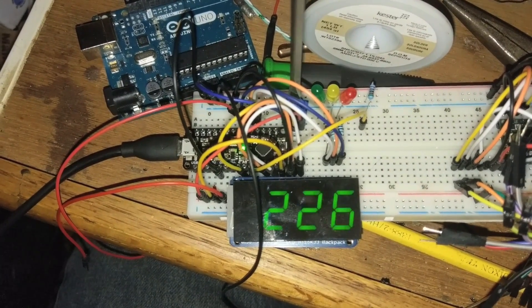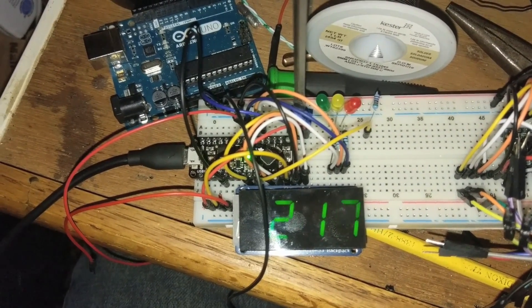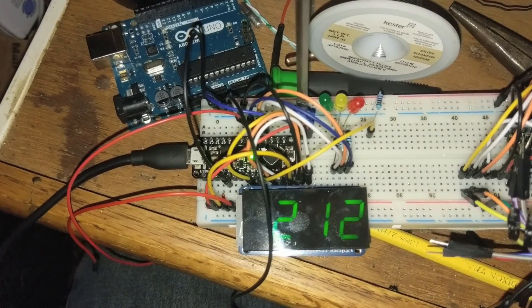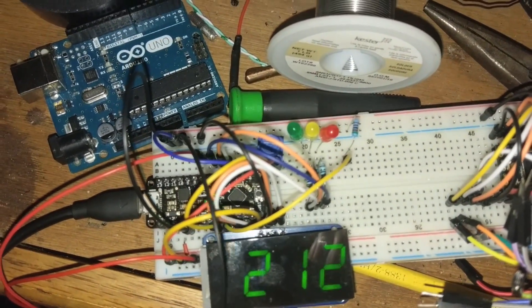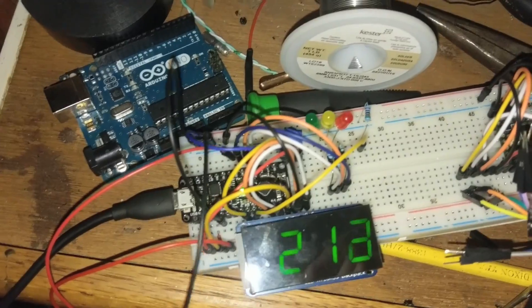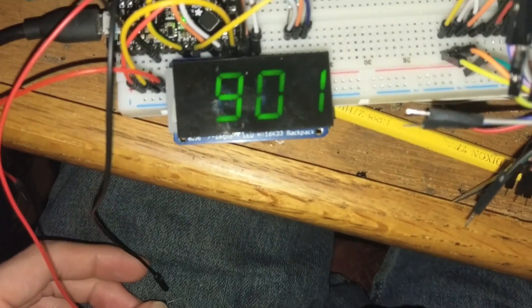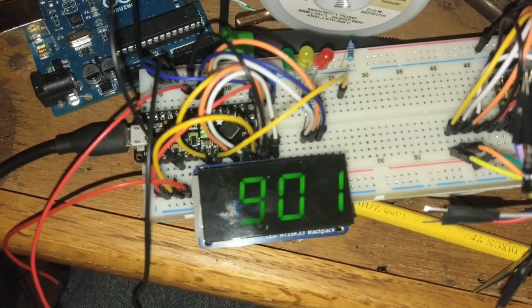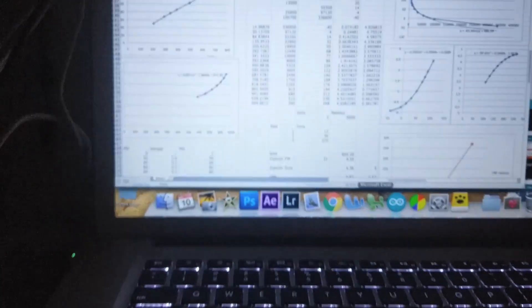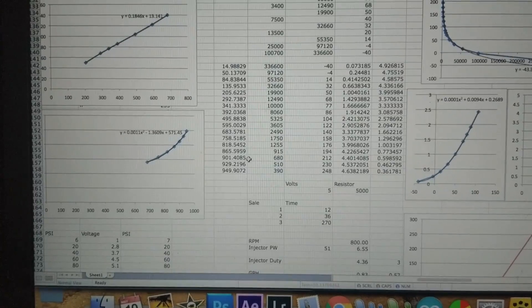How do we check? We can reverse our math. One of our plot points was 212. I wrote a little code - I have one pin internally pulled up, and if we ground that pin it switches to the raw reading. So if we just take these two wires and touch them together, now we get our raw reading. We get a raw reading of 901. If we come back over to the Excel chart, 901 is 212 - that is right on the money. That is perfect.